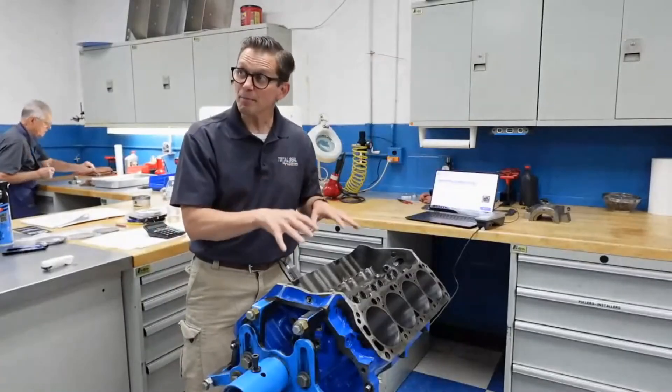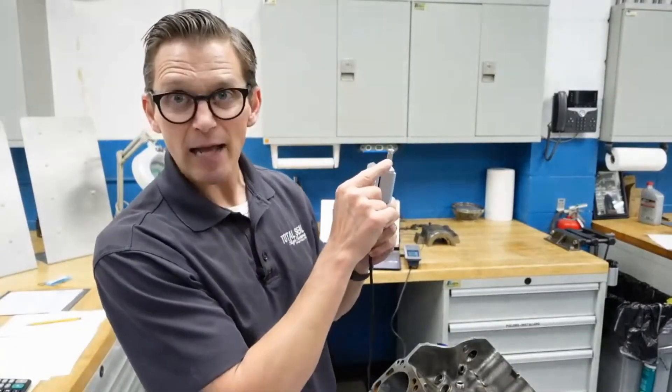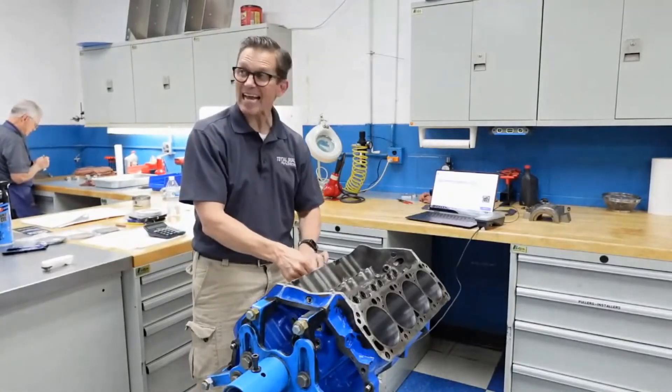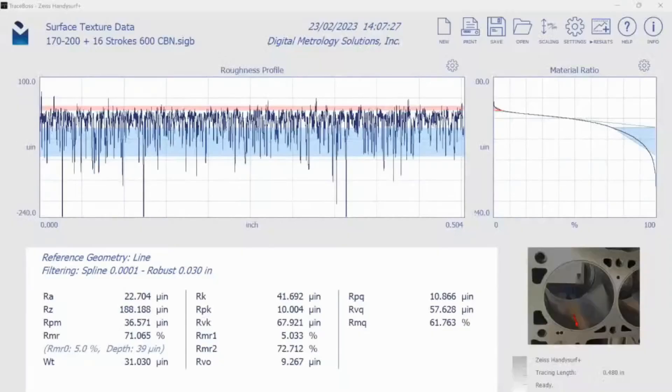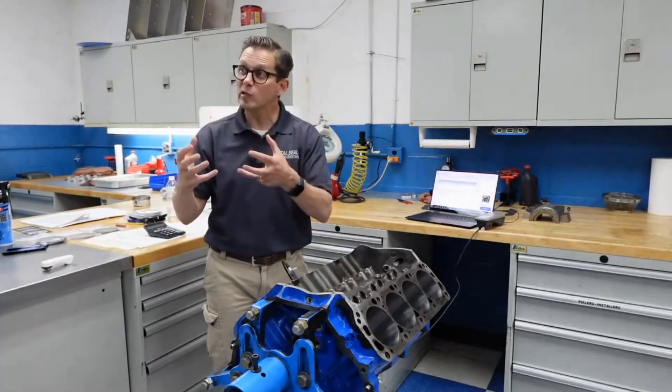This is the block that Greg Anderson honed - we'll leave a link to that video in the description below so if you want to check out the honing process you can go see that. What this process delivered we can actually measure with the profilometer, this really cool tool right here. The profilometer has a little diamond-tip stylus that actually drags across the surface of the cylinder bore - some people even call it a digital fingernail. It's a pretty great device; it can measure to a millionth of an inch and it's going to give us a trace that shows us exactly what that cylinder finish looks like. You can see it has all the valleys down there to hold the oil, and then there are those little peaks on top - those peaks we're going to be studying. How much do those peaks change from the hone to assembly and then post break-in? What we don't want to see is those valleys change much, or the core roughness, because that's what's going to be holding the load. We want to see this nice plateaued finish.